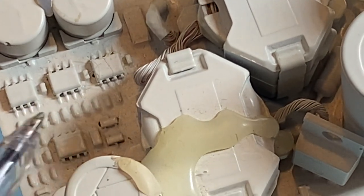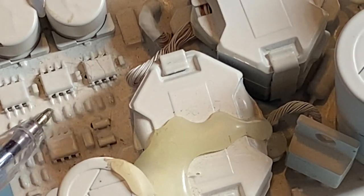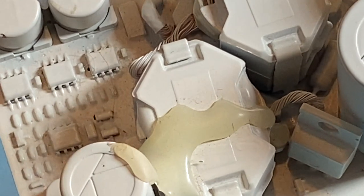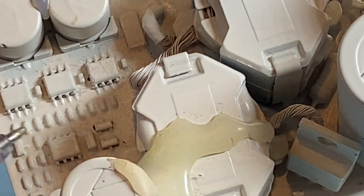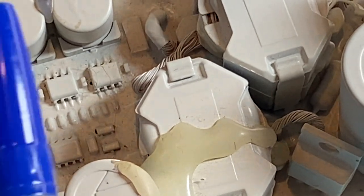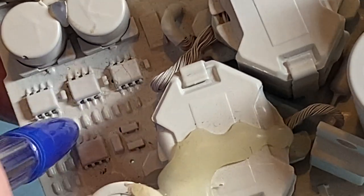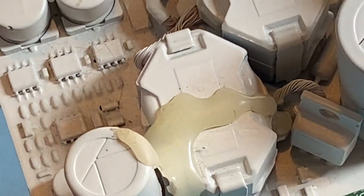So in this network here, you know, you might have a resistor gone open or come detached under the white paint from the board. Very hard to find. But in most cases, if you want to find if something's detached, get something like the end of a pen, have the thing on, push on them and see if something jumps to life. It's the quickest and easiest way to do it.